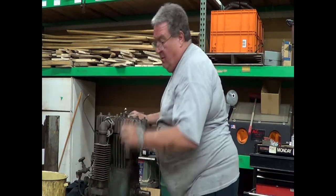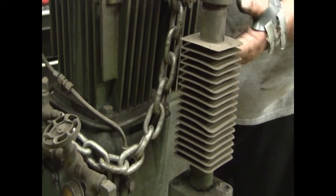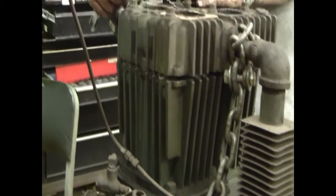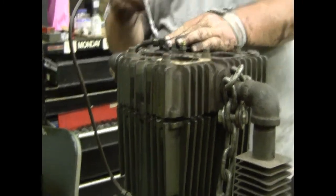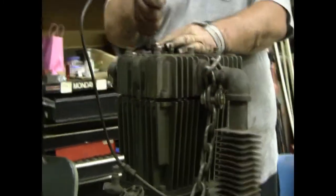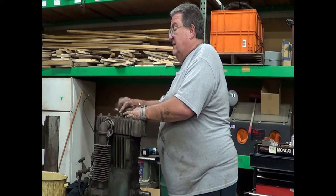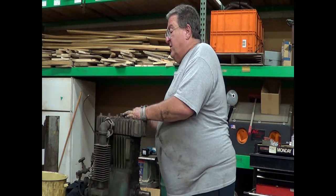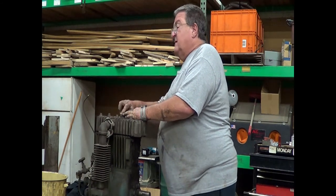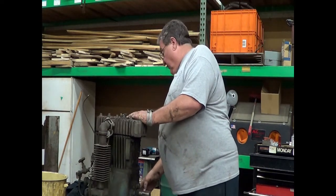This breather comes up from right here, and under here in the newer machines you have a little plastic ball that when crankcase pressure goes a little higher, allows air to pop up and go through the intake air. The 325s and 350s are internally breathed, which makes them an excellent choice for a dirty environment — sawdust, dust from cold stripping — because the machine breathes the crankcase atmosphere so you don't end up with contaminated oil.